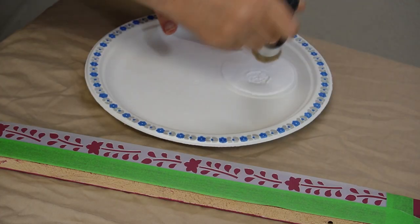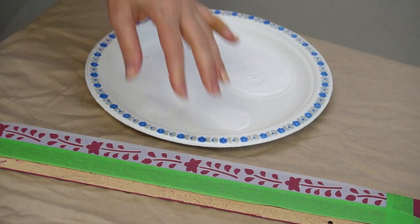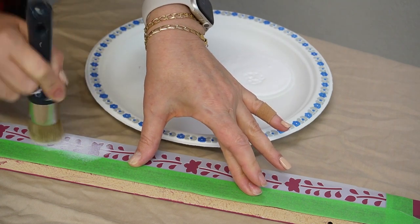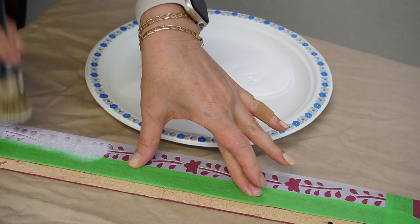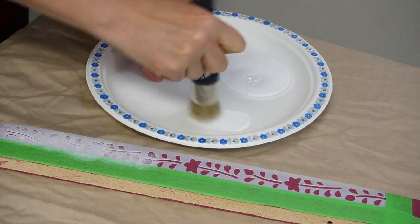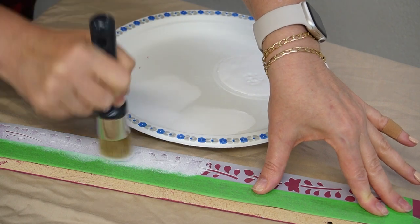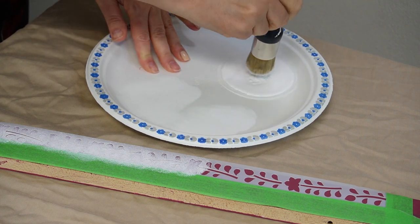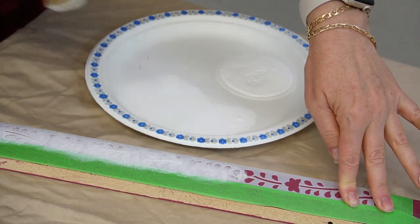The better way I've found is to add a little bit of paint onto a paper plate — here I'm actually just using paint from the top of the lid. Dip your stenciling brush into it, then offload the paint onto the paper plate until it really seems like there's almost no paint on your brush at all. You want your stenciling brush to be extremely dry. It will have some color on it, but it should not feel wet with paint at all. Eliminate all that excess paint, then start bouncing your brush up and down onto your stencil.